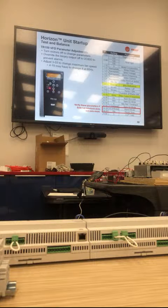Yeah, so when you call Danfoss, they don't recommend that you change that to infinite. We even work with Danfoss, but infinite is what we can do. Well, I've put a bunch of them to infinite. But when you call Danfoss, because that's who makes these drives, and you say that, they go, well, we don't recommend you do that, but you can. They don't understand that this unit's 100% outside air, so we have to shut that unit down immediately because of code. If there's a fire, we've got to hard stop this thing immediately. If not, I'm dumping in outside air and I'm feeding the fire. So we have a special exemption for why that's happening. So I have changed a ton of them to infinite.